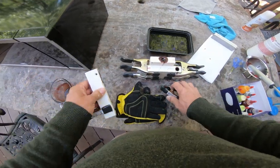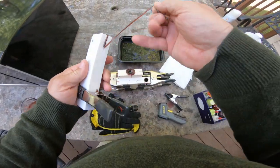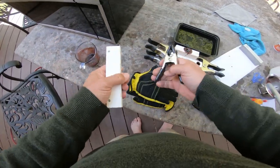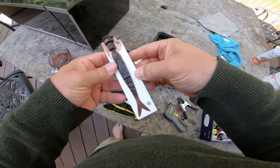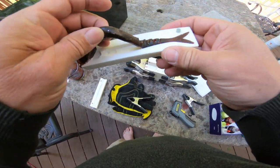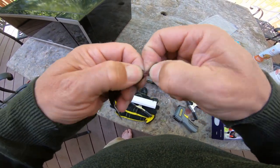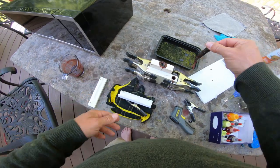Going to demold this one first because it felt the worst. Take all the little giblets and drop them back in the collection can. Loosen the little extra stuff around the sprue — the area before the bait actually gets poured — then pull that out. That's not terrible, that's usable. There's a little funkiness and some air down near the fin so that'll probably tear pretty easily, but it'll have nice action in the water. Tear off the sprue, clean up the extra, and you've got yourself a little swim bait trailer.